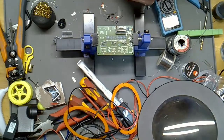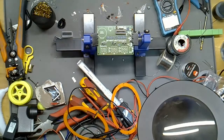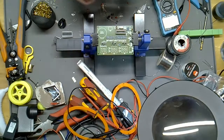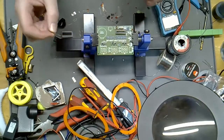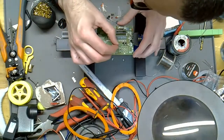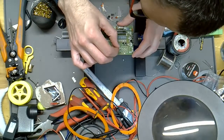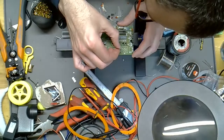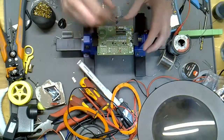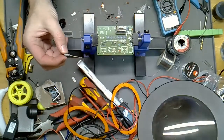Oh, right. So it's not long leg is negative. It's short leg is negative because it's a bad thing to cut off your leg. All right. For anyone else that wanted to know my reasoning, I thought long leg. Probably also could have looked at a capacitor that actually has the short leg where the stripe is.